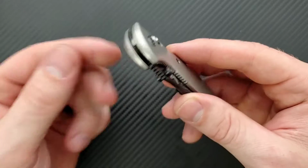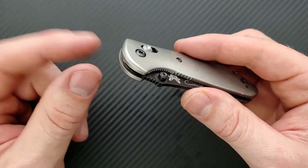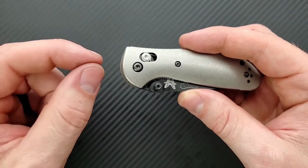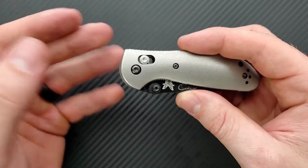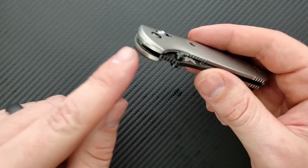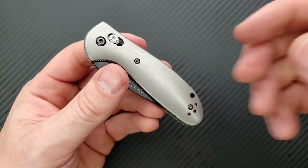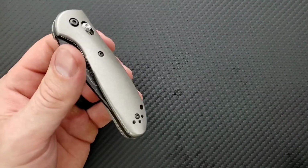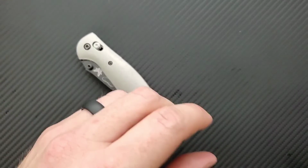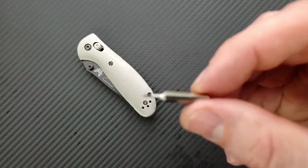And then this pivot barrel is D-shaped. So you got to work that in flush with this first liner and then slide in one washer and the blade, then slide in the other washer, because otherwise you're going to fight all three moving pieces at the same time. So the pivot barrel is holding in the washer and the blade, and then position that next washer. To position it, I was actually using a tiny flathead. You can use an itty bitty teeny tiny flathead, something like this. Whoops. Little flathead.